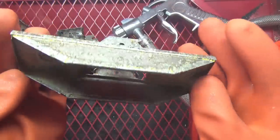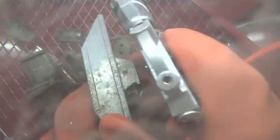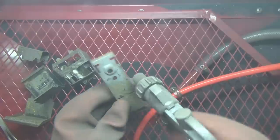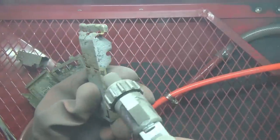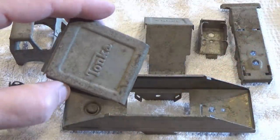I mentioned earlier I was able to remove most of the paint but not all. If you've seen my previous video on restoring Hot Wheels redlines, you may have heard me talk about getting new tools to speed projects up. One of these new tools is a sandblaster cabinet. I bought this after removing most of the paint from this truck, and I know it would have had no issue removing all paint and rust together. However, I've heard you should avoid that because paint flakes can jam the gun since the blasting medium is recycled and not really filtered. This is my first sandblasting experience outside of a small air eraser, so any comments on whether filtering the medium after heavy paint removal is necessary would be greatly appreciated.